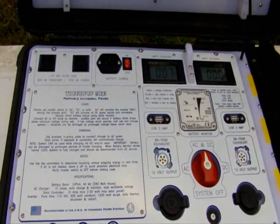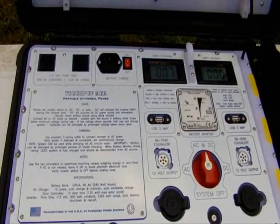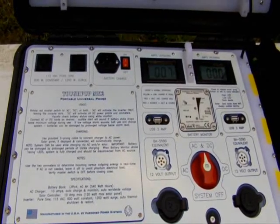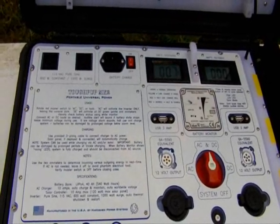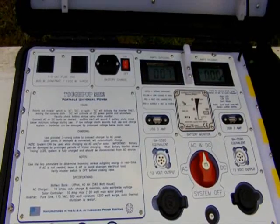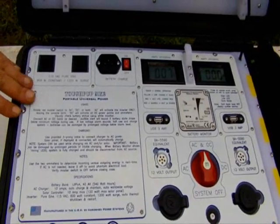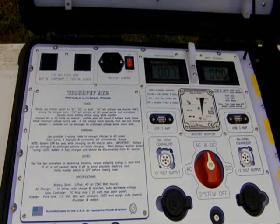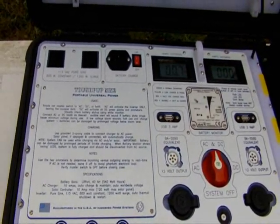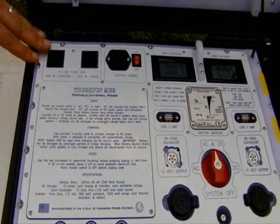It's pure sine, and I'm quick to caution people against spending the money for a pure sine inverter depending on their application. In most cases it's okay to use a modified sine wave, and just about any inexpensive inverter is going to be a modified sine wave. But if you've got specialized gear, some medical equipment, it can scramble clocks, and some things that use compressors can run pretty inefficiently. That inefficiency is one of the reasons why we wanted to go to pure sine on this. This is not a cheap system — retail price is definitely under $2,000 and definitely over $1,500. In keeping with the overall price point and quality, we saw fit to spec a pure sine inverter so the customer doesn't have to wonder if it's going to be okay to run their gear.